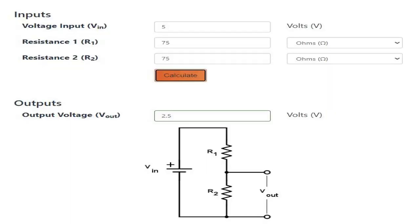Normally in my previous videos, I created a voltage divider. You grab two resistors at the same value — you can use 75 ohm resistors, which I generally use, or 100, 250, whatever — in series, one end to input and one leg to ground. That centre tap will halve your voltage. So if I have 5 volts going through the resistors to ground and tap the centre point halfway between the two resistors, that voltage will reduce by half, as long as the two resistor values are exactly the same.